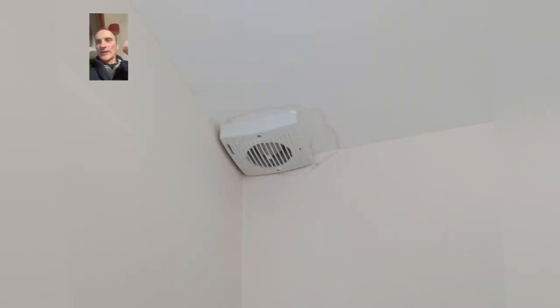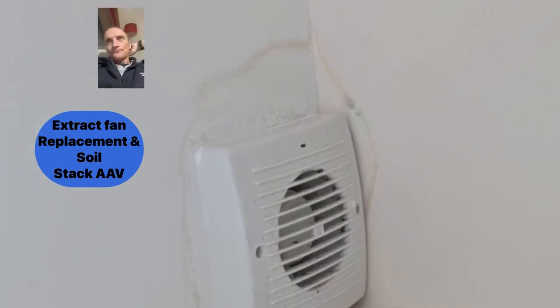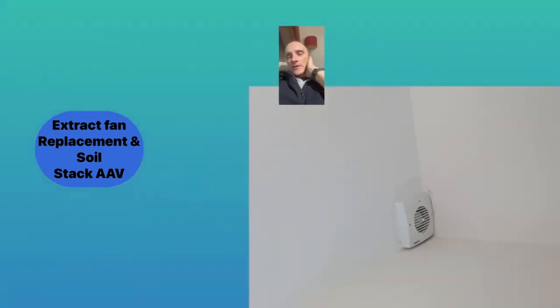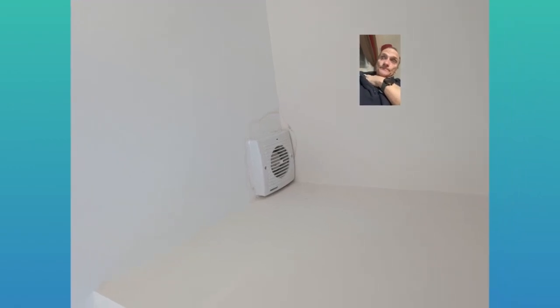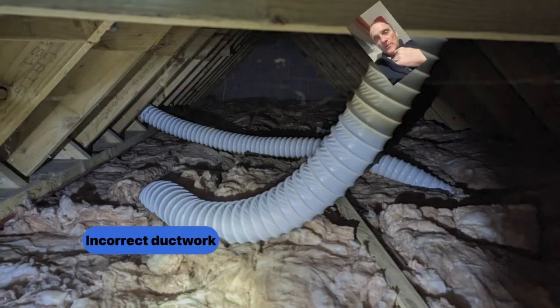Welcome to my channel Oxfot Tiling. Today we are doing two extract fans in a house. They're rubbish extract fans in a domestic premise. They've been routed via non-insulated ducting, so with the freezing weather it's caused issues with condensation dripping down into the fans. I've gone in and replaced the fans with quality items - not inline, just direct ones, but quite expensive: the Vent Axia. And I've rerouted them into the eaves.